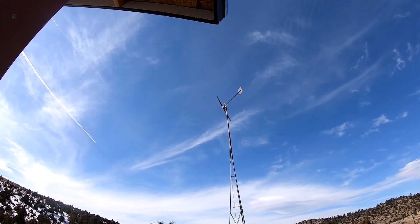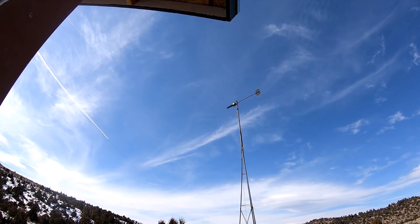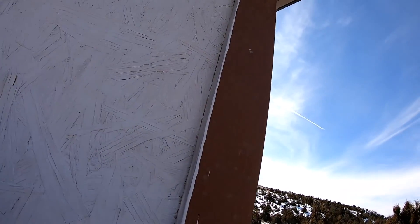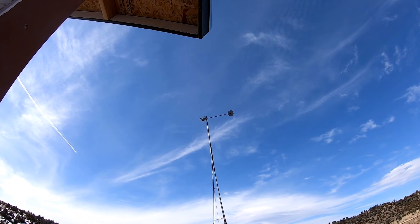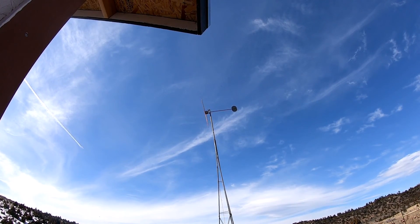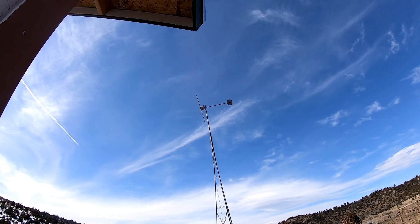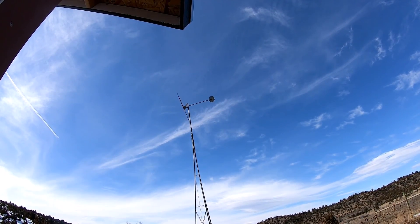The wind finally picked up a little bit and looks like it's working — I can see it closing the contacts, though it's probably hard to see from here. I'm standing behind my building so the wind doesn't blow out the microphone. With just a little gust I can tell the geometry is a little off — the alternator looks a little low to the hinge, it should be a little higher. It's having to blow too hard to make it work, so I might have to add a little spring to give it an assist and have it kick in a little earlier.